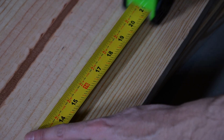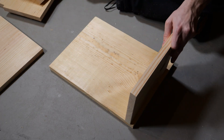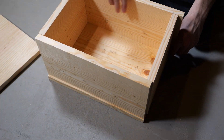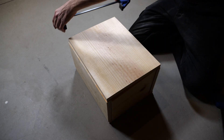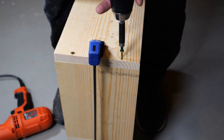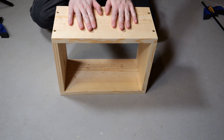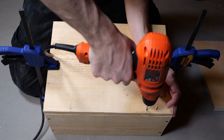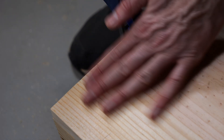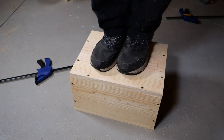With all the components out of the way, it's time to start building the enclosure. I go ahead and measure, mark, and begin to cut out all the pieces for the sides of the box. With all the pieces cut out, I line them up to make sure everything fits nice and snug. Once I'm happy with the shape, I take some wood clamps, clamp the sides together, then drill and screw the sides tight. I lay the top on, clamp it in place, drill and screw it tight, and do the same for the bottom. The final shape of the box is super strong and I'm super happy with it.